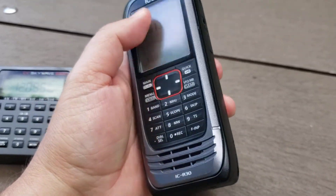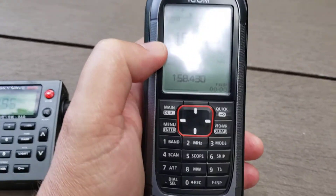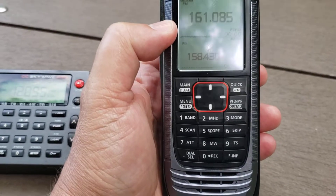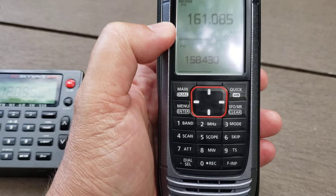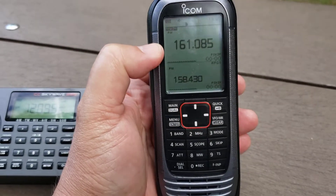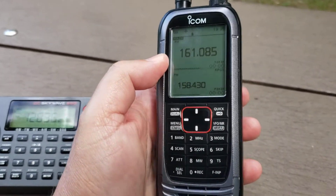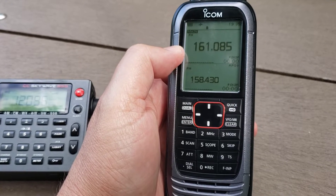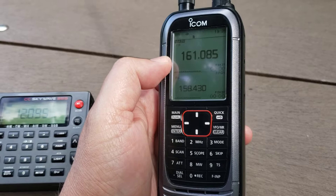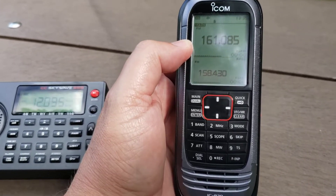My biggest complaint is how easily this radio overloads. I get messages saying I don't understand the two receivers — I totally do. One performs better than the other; one does digital modes and the other doesn't. But both are poor performers, one more than the other. I live in a high-signal environment and it overloads constantly, to the point where I need to use the attenuators all the time. You should not have to use those features unless you're in extreme conditions — this simply tells me the receiver lacks what it needs to be good.